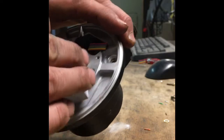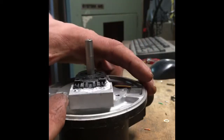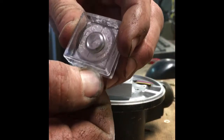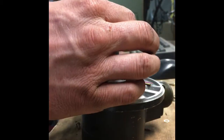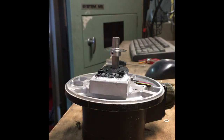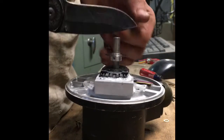Basically we glue this base down to this block. It looks really ugly because I tried to harden the super glue with some baking soda - it works pretty well but makes a mess. This is our encoder wheel; we don't want to put a fingerprint on it so we grab it from the sides, slide it on the shaft. This right here is a spacer that comes in the kit - you drop it down and kind of tease it into place, past that little ridge.